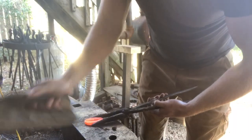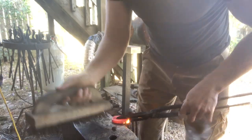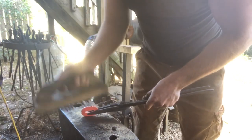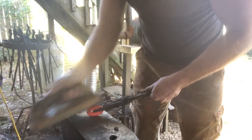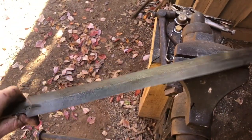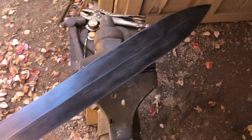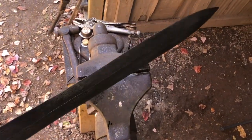While the sword's in the acid bath, I'm thermal cycling the fittings a few times and taking a brush to them whenever they cool down. We oil them while they're still a little warm — this gives a really nice smooth black surface finish. After two 20-minute etching cycles, the pattern is looking pretty good. Need to clean it up a little more, but next step is to go ahead and sharpen this thing before we put it all together.